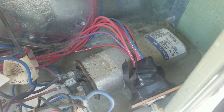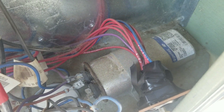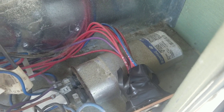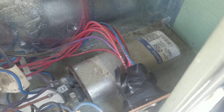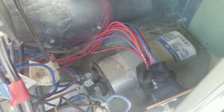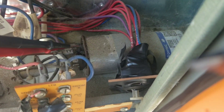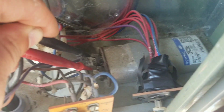Real quick — as I was starting to get my testing equipment set up, meters, gauges and all that, I noticed a little bit of oil on the outside of this capacitor. Sometimes that's electrolytic oil leaking out of the capacitor. So I went ahead and discharged the capacitor already, pulled the wire off, and of course my disconnect is off. So we're just going to put some leads on here real quick and make sure this 20 UF capacitor is indeed good.